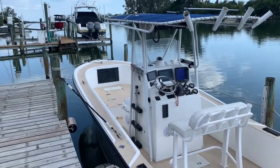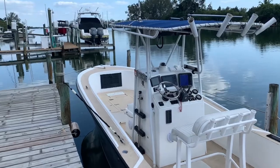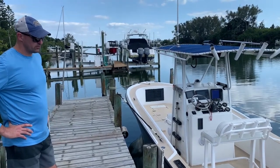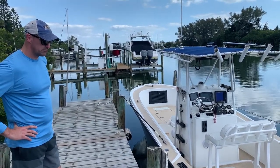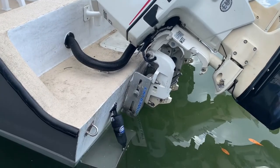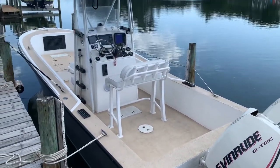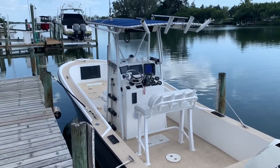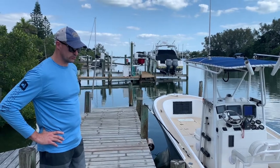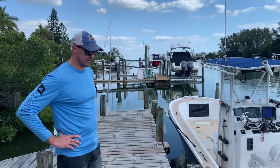It runs good. We were just looking at one of the trip meters and we've put over I think 1300 miles on this boat since we got it back in the water for the first time. We set the motors off the transom with 4-inch permanent jack plates to be able to raise the motors up. The dynamics of running in shallower water is important here in Florida anyway, and the further off the transom you get, the higher the motors can run. That design has worked well for us, especially where we bring the boat now along the intercoastal, where it can get pretty shallow in some spaces. Being able to run a little bit skinnier is not a bad thing at all out here.